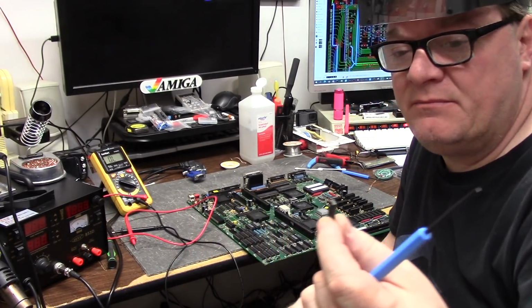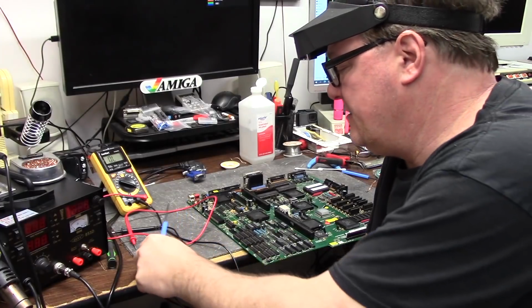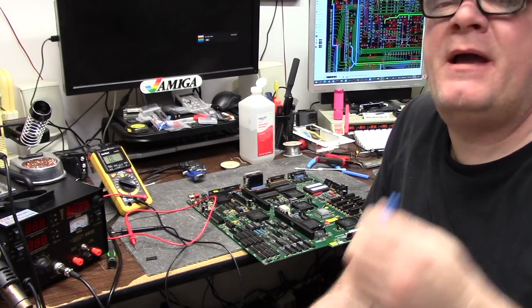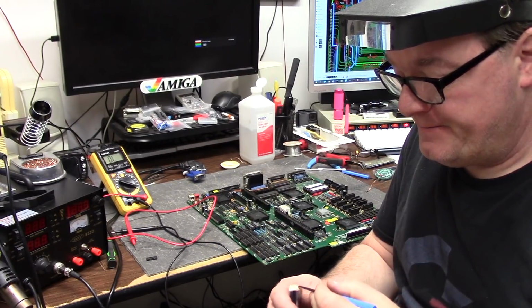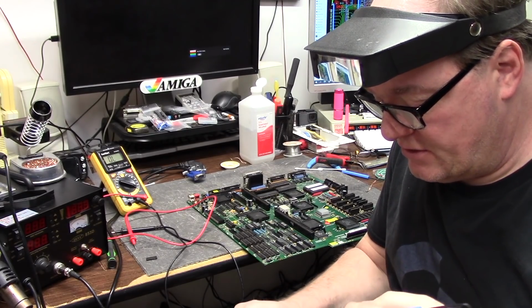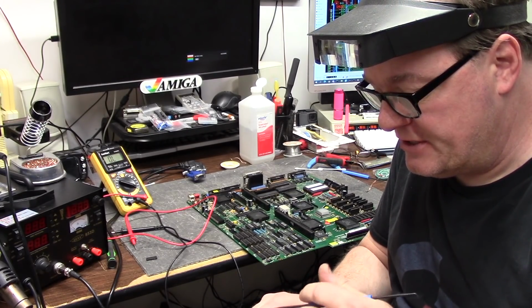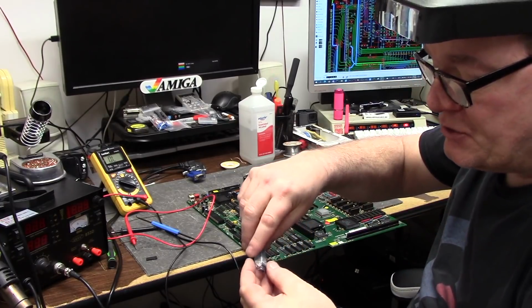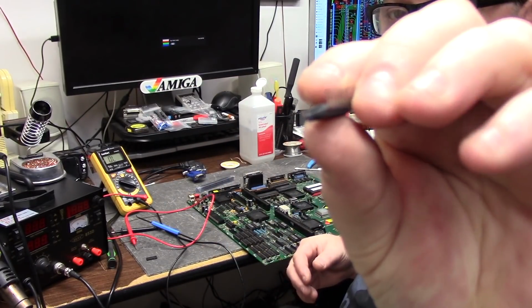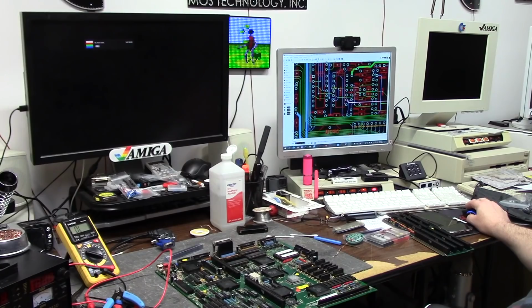Anyway, last night, around midnight or whatever it was, I cut out the 74HC02, whatever the heck this is, where I discovered some hidden battery damage, a busted trace, and more importantly, battery scuzz. So I'm going to replace that chip with a brand new one. I have a couple bodge wires to do underneath of it. These are brand new chips, legs spread far. I went through the pinouts.